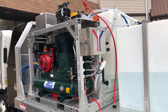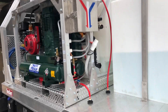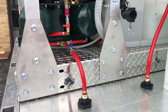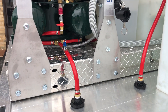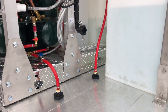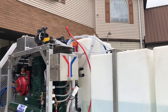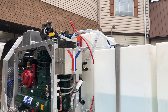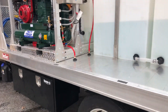That red line coming down and going through the deck — there are actually two red lines going through the deck. The first one is just our dump tube for the air compressor. These air compressors need to be emptied every day, so we want to make that as easy as possible — you just open up those ball valves and the tanks will drain quickly. The second one is our bleach vent: a hose barb going through the lid of the tank with a hose connected to it, and the vapors just gas out below the truck.